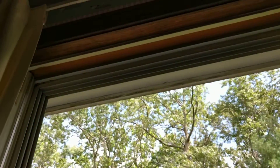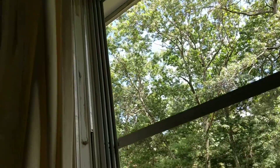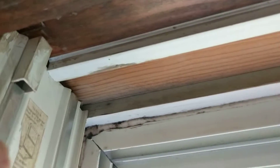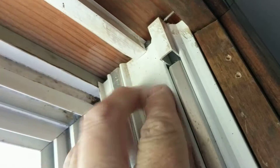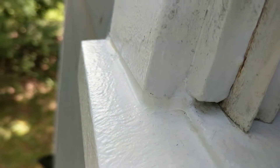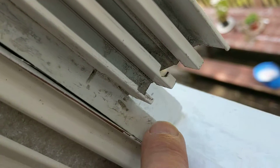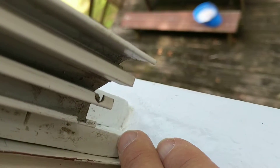The jam liner is in place. There's a piece at the top here that goes in after the jam liner — a sealing strip that helps hold it in place. I also have caulk underneath the window casing. I did leave an eighth-of-an-inch gap and I still need to caulk under this part of the window hardware. It's painted with multiple coats — two coats of primer, one coat of top coat into that gap — so the idea is to make it as waterproof as possible.